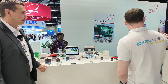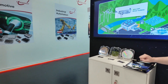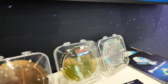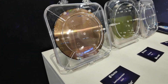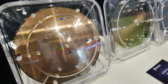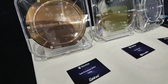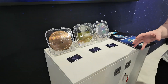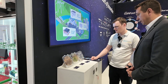I'd like to walk over here where it looks like we've got some dies, and I'm guessing these are GaN dies. Yeah, starting from the last, we've got a GaN processed wafer — this is a six-inch wafer. We use TSMC to process it; we do all the design and they do the processing. TSMC? Yes. They support GaN technologies? They do, yeah, for several years — they're the main player for GaN on silicon processing.